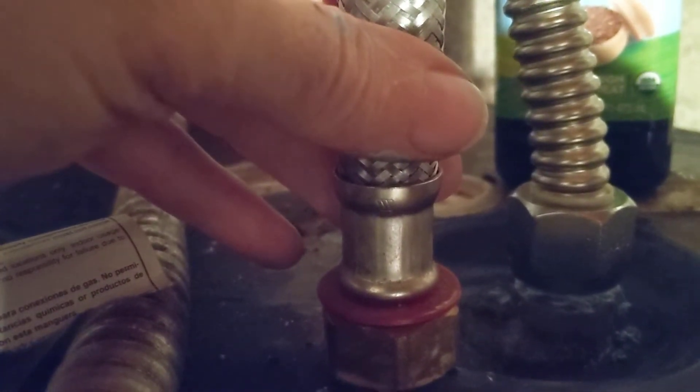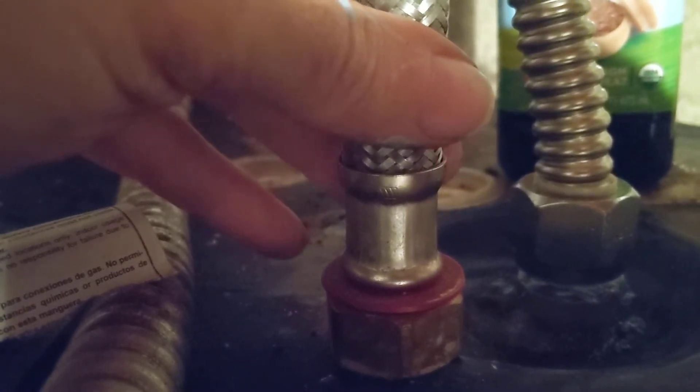That's all I was sharing. I also recommend against the shark bite — but that's my opinion. Using it inside in the house, the shark bite is something you can twist on and it doesn't leak when you twist on it, but I don't really want any of my fittings being twistable and slip and slide. Shark bite for speed — a lot of people are adopting it. It seems to own the water heater market. It was bizarre on Home Depot's website. Shark bite is everywhere on Lowe's too. What's going on with people wanting to put the shark bite on the water heaters? It's a hot water supply — why would they do that?